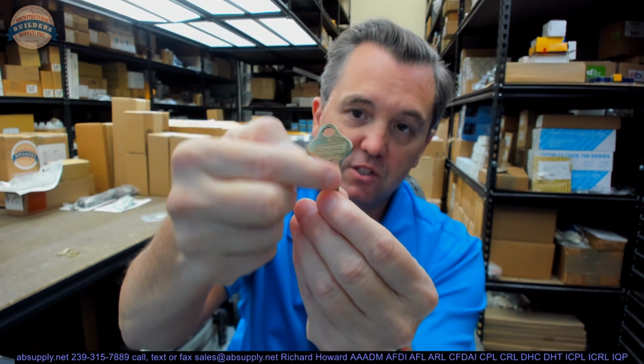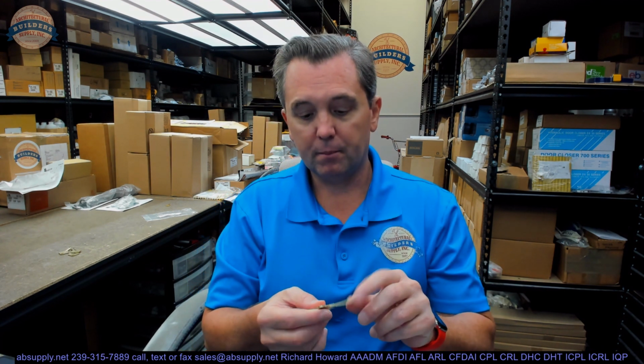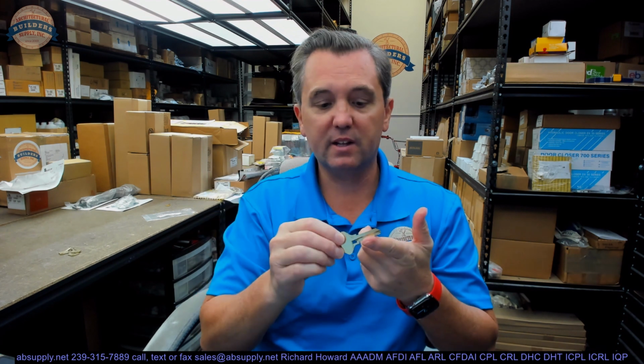We know it's 29 because of the shape of this key, and I'll discuss that in a moment, is a natural evolution out of the C through G or FG keyways, those 7 keyways. And it's an evolution that's beneficial for 2 reasons. Number one, it's certainly more secure, period. Picking open a lock with a Schlage C keyway could be a relatively easy endeavor, even by someone with no prior experience. The check pin is going to change that sort of concept, so it's more secure.